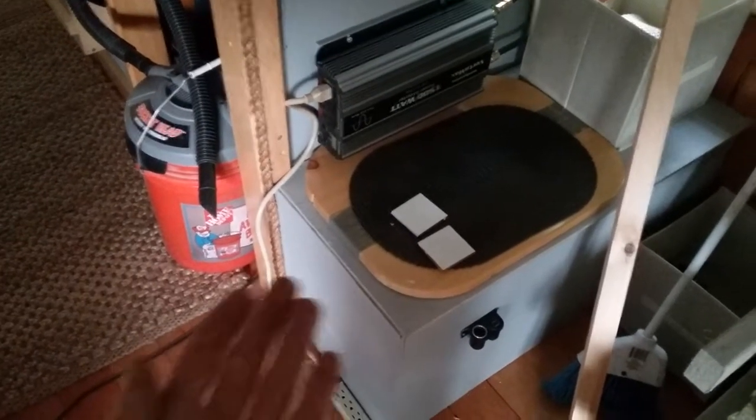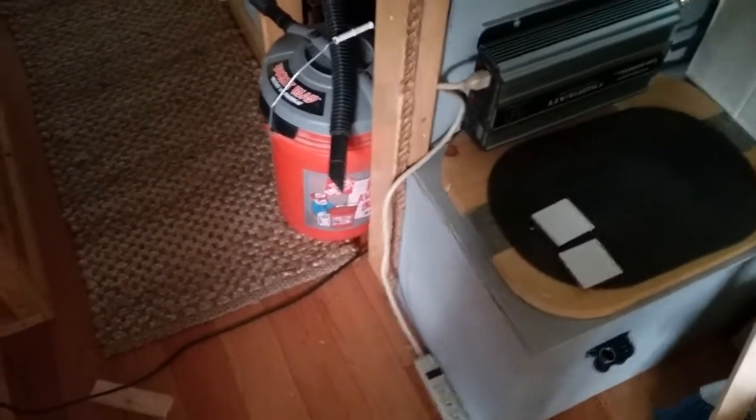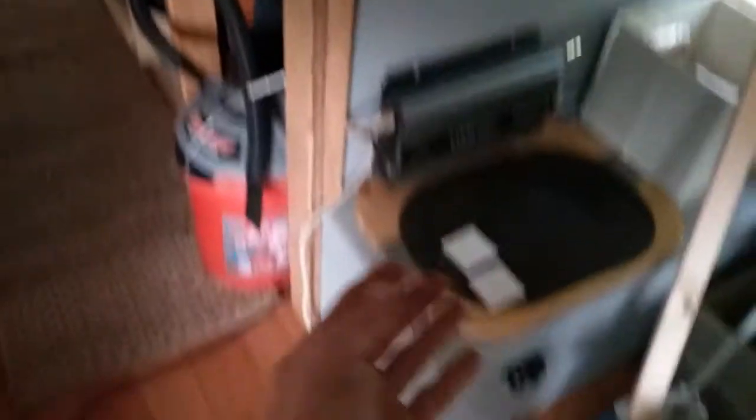If I was to turn on my distribution panel right now and I have my phone laying there charging, and I didn't come back to the bus for three days, that could technically drain my batteries until they were garbage. So just make sure you guys have those fail safes so that never happens. Most of the time you won't have that problem because you'll have your solar panels on and you'll always have some juice coming in and your charge controller will be on. But people do things where they hook something up directly from the batteries just to use the juice and forget that it's always running. So just be aware.